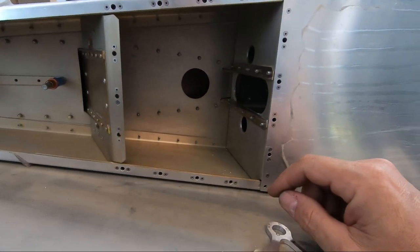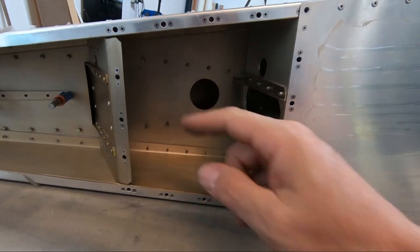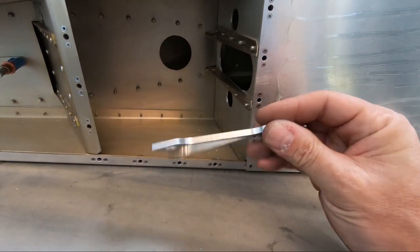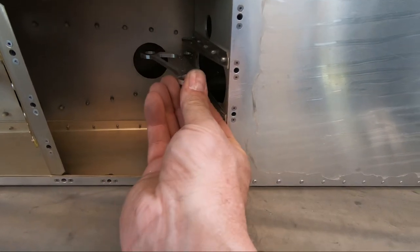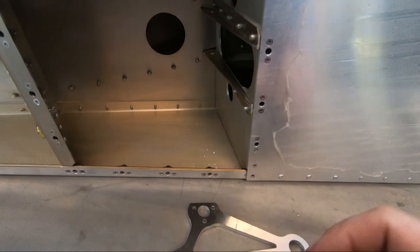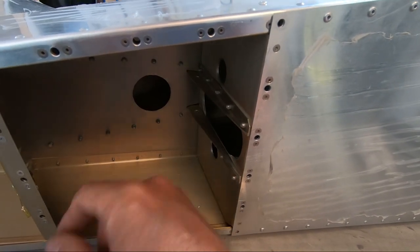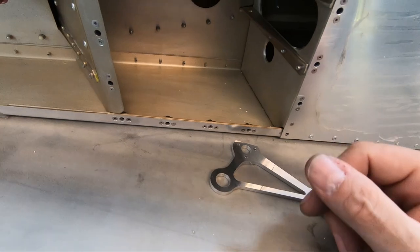The rear bell crank for the horizontal stabilizer — which comes from the front bell crank we just finished and goes up the vertical fin — gets mounted between the two bolt holes we drilled a long time ago for a quarter-inch bolt. I cut this out on the CNC machine; this is basically the bell crank assembly that needs to be mounted where that bolt goes through, and it pivots to transition the control rod from this direction up the vertical fin. I'm missing a bunch of parts — the bolt is on back order, the steel I need to create the bushing is on back order — so I can finish getting the bearings installed but I can't install it in the airplane at this point.